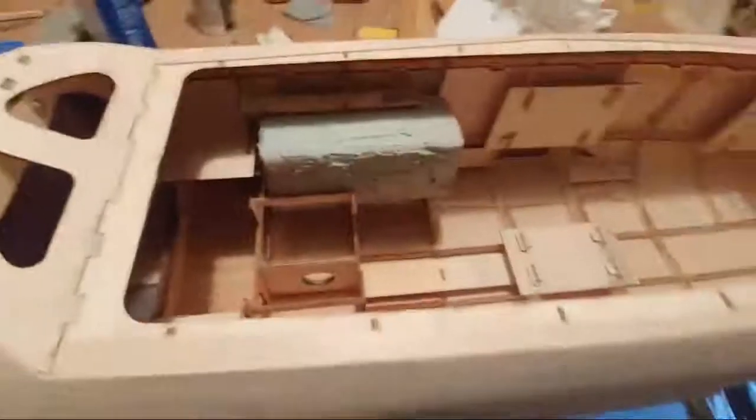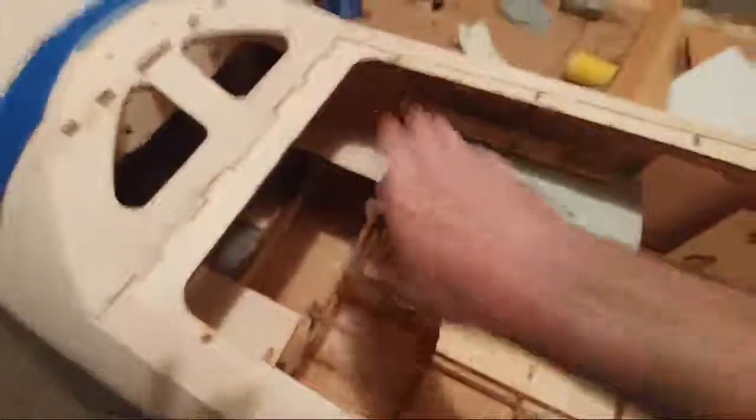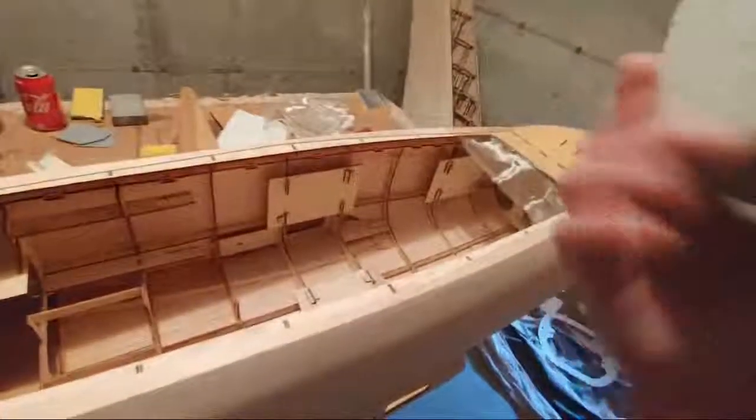This shop is a mess. But anyway, I got to get this all done so that these pieces and parts will go. Once this is sanded down, I got to sand these down and make them fit in there, like so. And that's the size of the fuel tank that goes in. Of course, the turbine sits right in front of it. I've not decided whether or not I want to raise this up anymore. I don't know yet. But anyway, I'm going to get this done, and then we'll 2K primer that one, wet sand it down to probably 800, and then we'll send it over to Mr. Moore to go get a plug made for Kevlar fuel tanks.